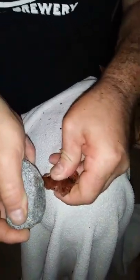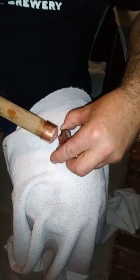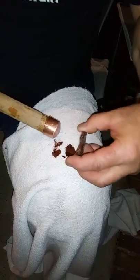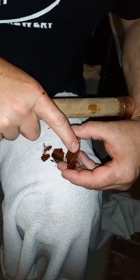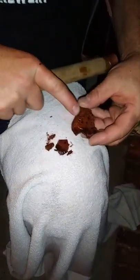I'm going to stone grind this whole side. I told you about isolating platforms — see how this is sticking out right here? You want to isolate that, so take a corner and go on either side of it. Made it stick out even further — now stone grind it to make it strong. That's an isolated platform. Hit your angle, hit it right there on that tip — shot it all the way across off that isolated platform. That was a stone ground isolated platform and it shot all the thickness off, taking it all the way across.